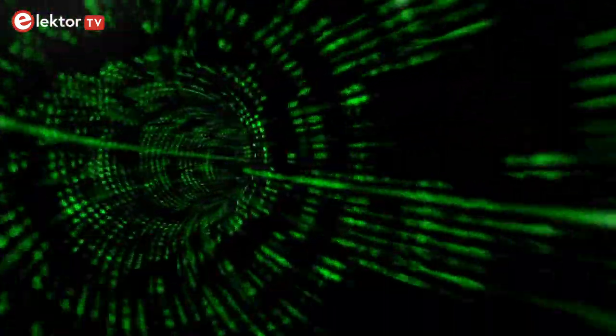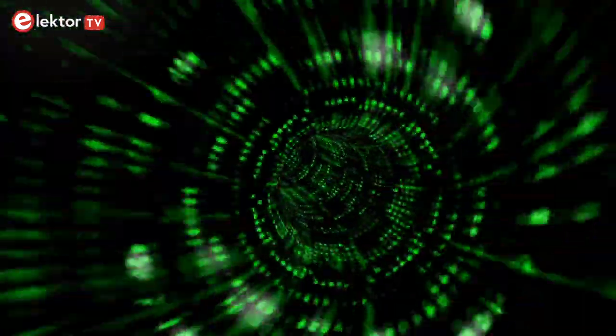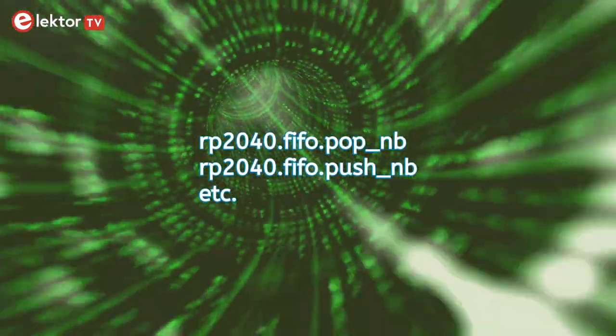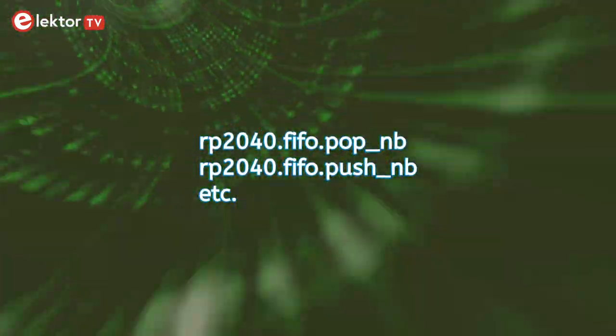The preferred way of communicating between the two cores is by means of special message FIFOs or pipes. There are two of them — one from core 0 to core 1, and the other from core 1 to core 0. You push in a message on one side and it pops out at the other side. This provides safe core-to-core communication without worrying about one core messing up the other's data. The Arduino RP2040 package exports an RP2040 object that lets you use the core FIFOs easily, though you must define and parse your own communication protocol.